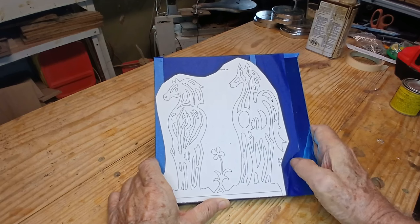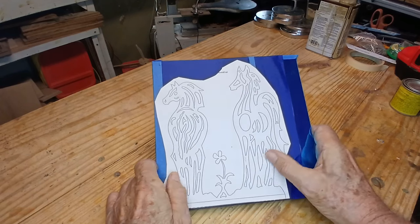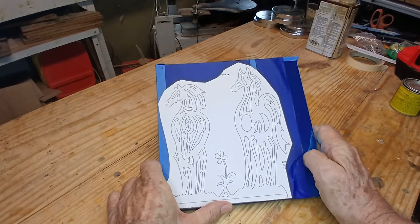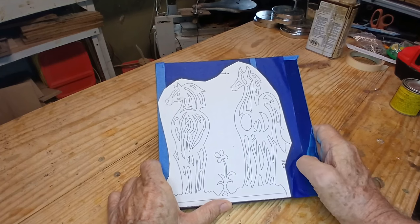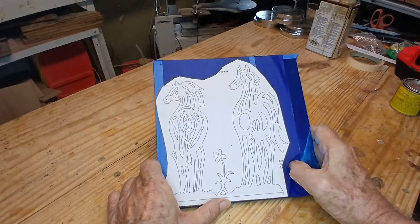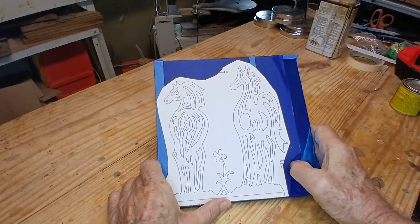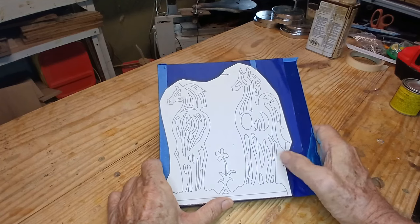So doing that in a straight line is one thing. You can go ahead and break it off, but doing fretwork like this, this may not work. It's an experiment. And in fact, you may not see this. If you see this, then you'll know it probably worked. So I'm going to drill these holes. I'm going to get over the scroll saw, and I'm going to very slowly and carefully cut these internal cuts.